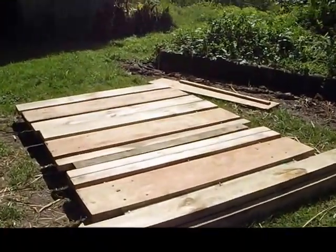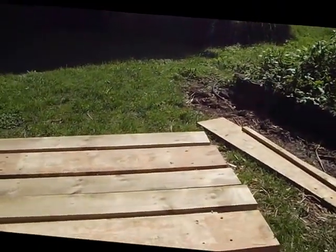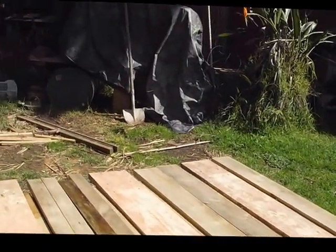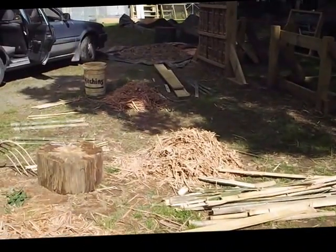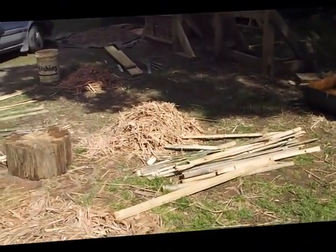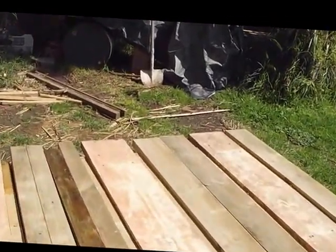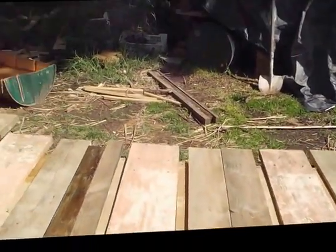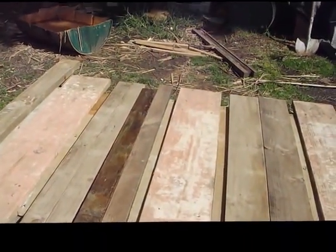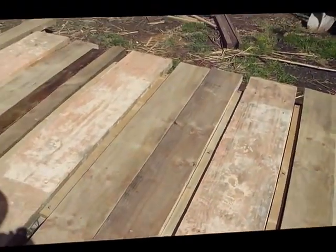Okay, here's the shuttering system that I've just created, so that I can tamp the Pampas light earth mix down hard against the slats without it dropping through the bottom of the lattice of slats, as I've showed you in previous videos, where it tended to poke out a bit, and so this now is just going to hit hard against these shutter boards.